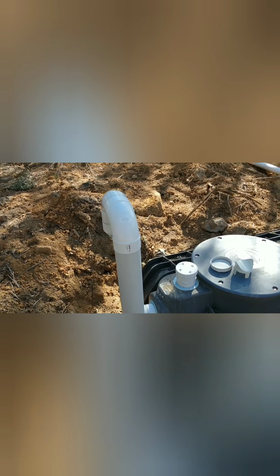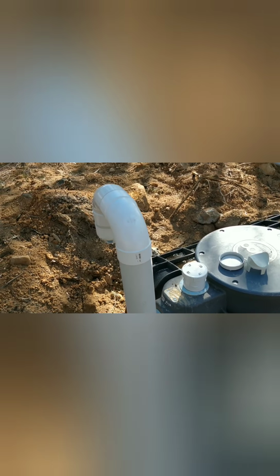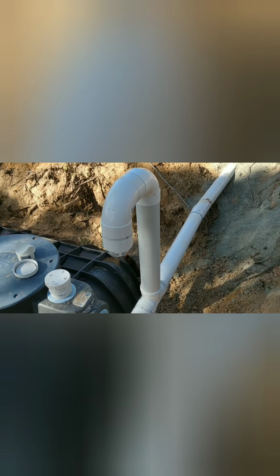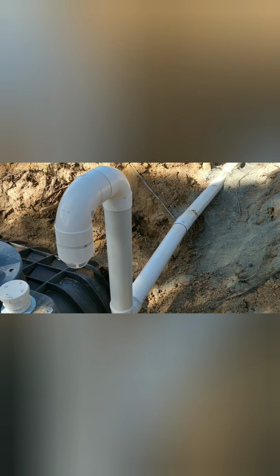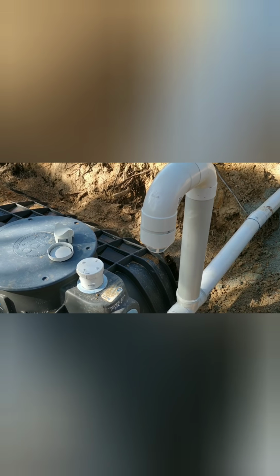And here we come into the septic tank. So this septic tank, because it's, I can't remember what the spec is, 6 meters or something away from the surcharge gully, if it's that far away, it needs to have a separate vent on it as well, and that's what that interesting upside down J piece of pipe is. That's a vent for that.